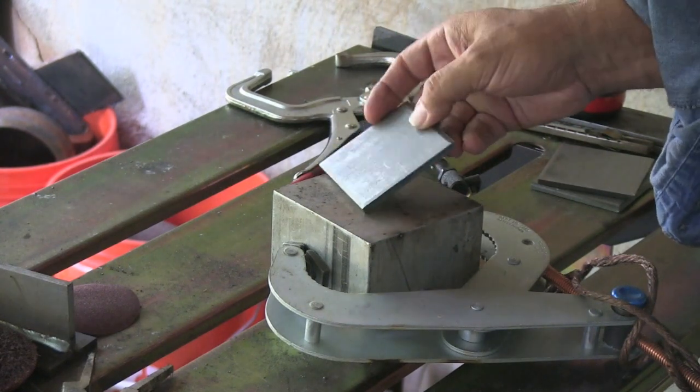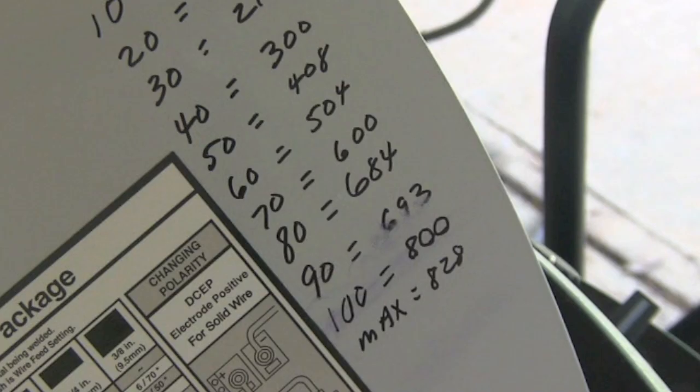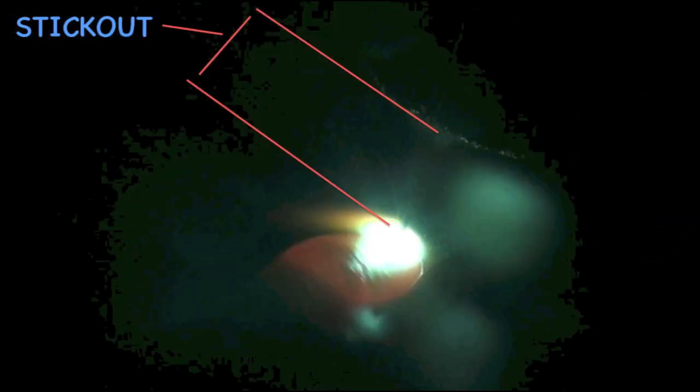Now I'm using quarter inch steel — these pieces came with the kit as well, so I've got to crank up the settings a little bit. Using .024 wire, the wire feed speed needs to go higher. The smaller the wire, the more wire feed speed you need. My chart shows I'm up a little over 600 inches per minute — it takes a lot of wire feed speed with .024 wire. The first bead I'll run is right on the edge, watching the puddle melt just over the corner of this quarter-inch piece. Pay attention to stick out — you want to keep a short stick out on thick steel, meaning half inch or less.